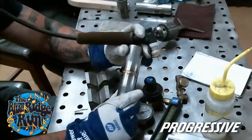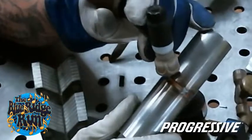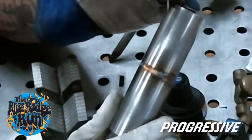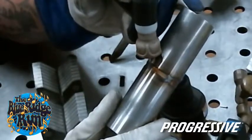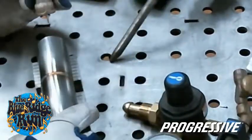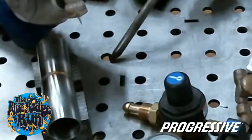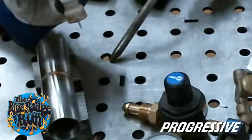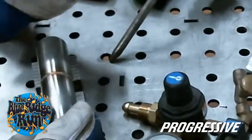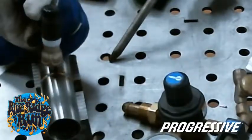It's pretty common, if you stop the weld too fast, you'll get what they call a little fish eye. It's a little hole in the weld, and you don't want that. You can even see it in tacking where he had that tack. If you pull off too fast, it creates just a little pinhole. You can wash it out with a little heat, or if you had a blowout, you can throw in a little rod to touch it. Once you do that and feather it in, you can make it look like it never happened. But if you see that, it needs to be corrected, and this is the quick, easy way to do it.